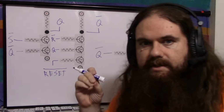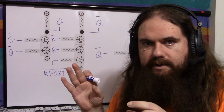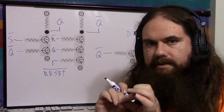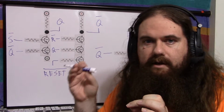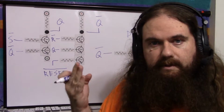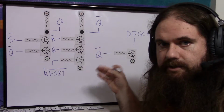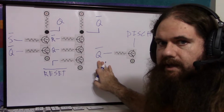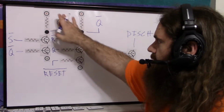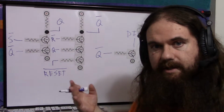That's the idea. When the timer is on, if you're using a capacitor in monostable or astable form, then the capacitor should be charging while the timer's on, and when it reaches a certain value, the timer flips and you discharge the capacitor on the timer through the discharge pin. So the output would go low and then discharge would open up. So when Q0 is high, that means Q, whatever it actually is, but the conceptual Q would be low, as in the timer would be off.